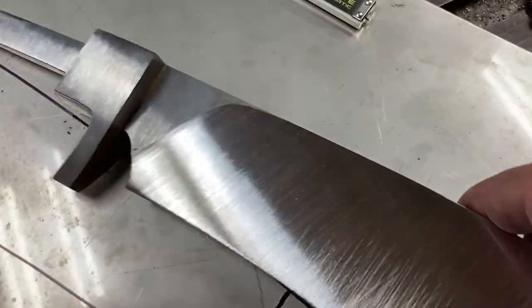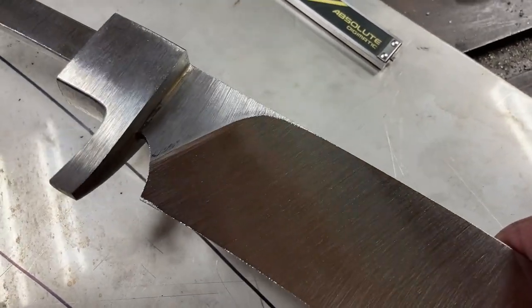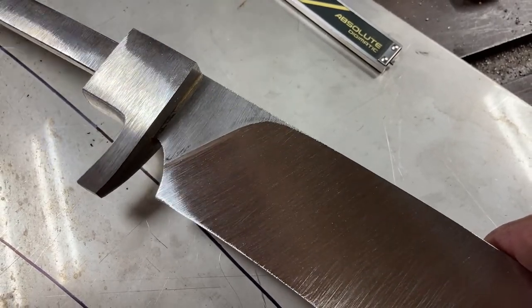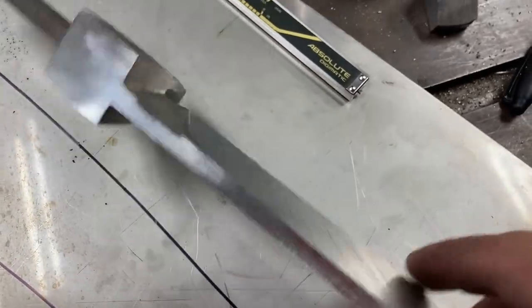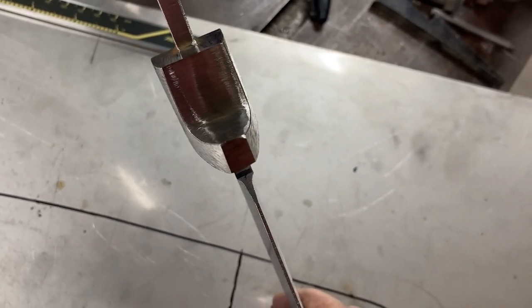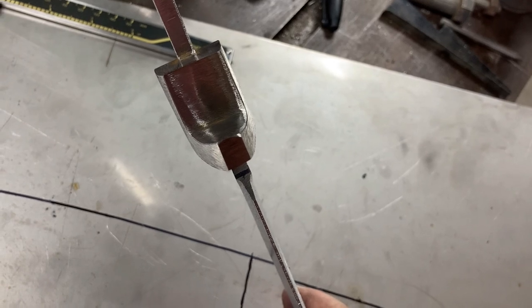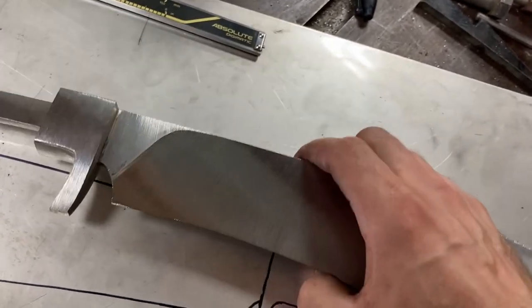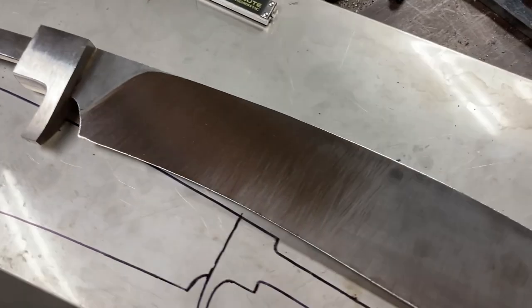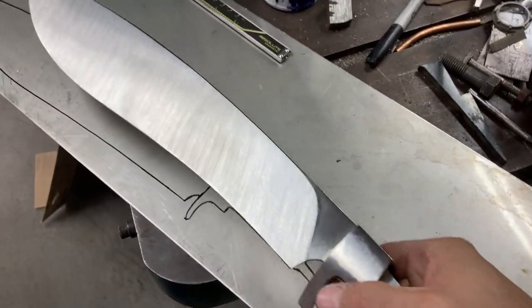And now we're good here too. Again, nice smooth, pleasing line. Gentle arc at the top, close to the line but not over it. Good enough for heat treat, and we will get the rest later. Right down here from below — those are pretty darn even with each other for now. We'll get them better once we're at about 120 grit or even with the A100 Gator Belt after heat treatment. But we are good for now. So that concludes major bevel grinding and plunge cuts for the entire blade pre-heat treat.